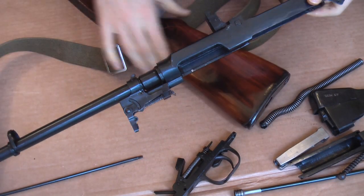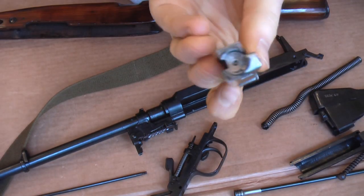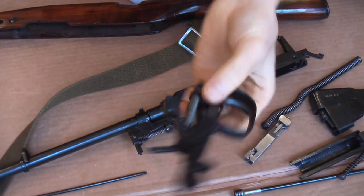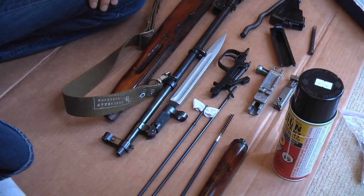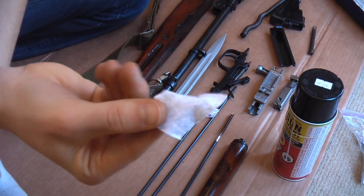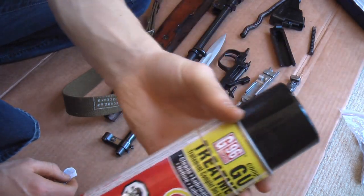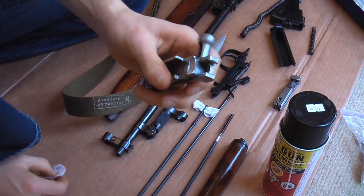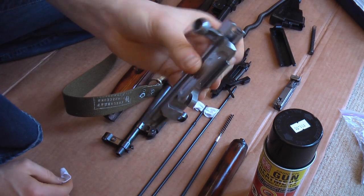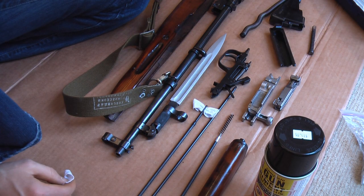Actually, you should also tap out this pin and clean out the firing pin — I'll do that every few times I come back from the range to keep the firing pin from sticking, since this one is floating with no spring. Before throwing the gun back together, here's briefly how I clean it: I take little patches cut from old t-shirts and wipe off all the parts. If any part is particularly gummed up I'll spray some G96 gun treatment on it and wipe it off again. Once the parts are fairly clean, I soak a patch with the G96 and wipe down all the parts to give them a light oily coating. I don't spray additional oil — just wiping with an oily cloth is good enough. You don't need to go overboard oiling your gun.